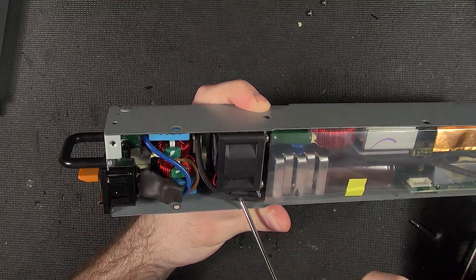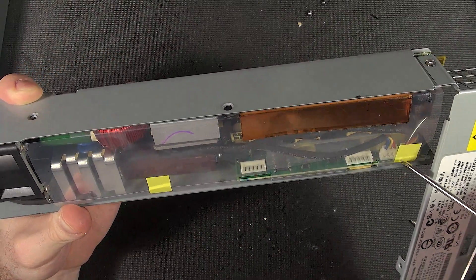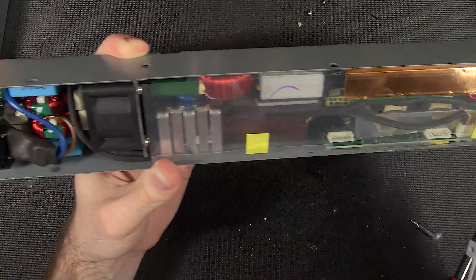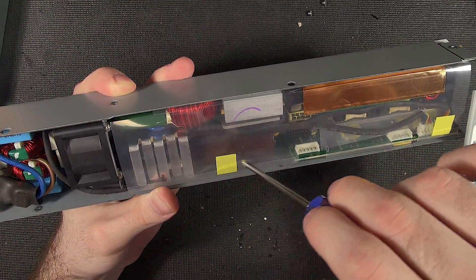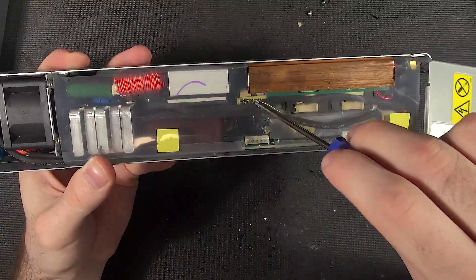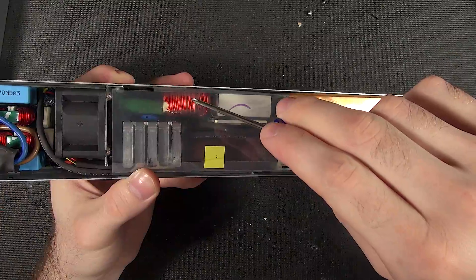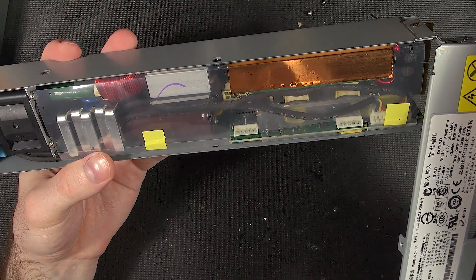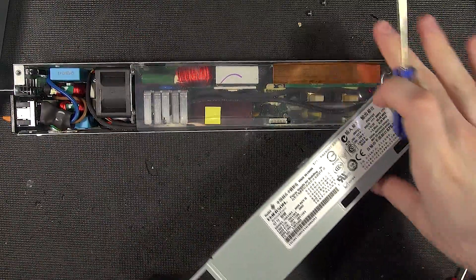Different arrangement here — the jumper heads all the way over to this part of the board, and there's also another connection going down to the bottom board. There might be a chip to understand what's going on, but the numbers keep being on the bottom. Here's the giant filtering capacitor for the main rectification. Looks like two large transformers, some smaller transformers or chokes, a very small likely transformer, an 8-pin DIP package, a very large choke. This power supply seems to actually have a 3.3-volt rail at 0.2 amps — that might just be for their version of standby, with 12 volts for actually running.